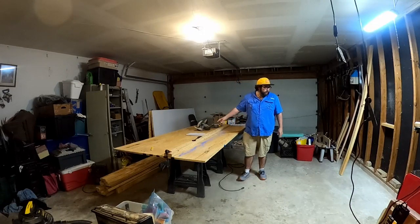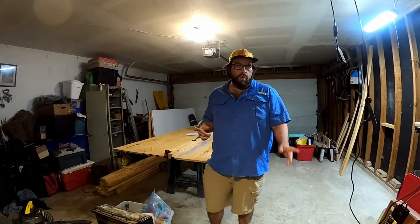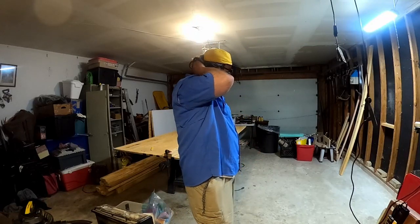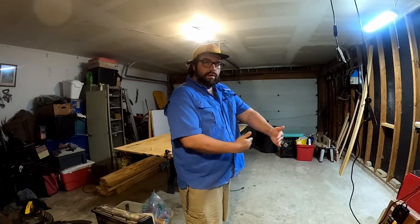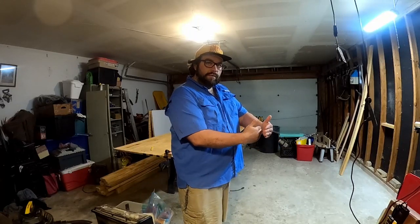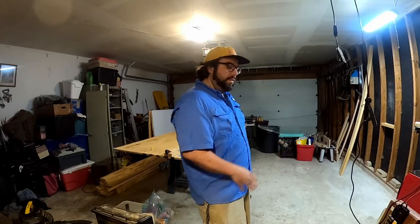We'll have the top layer for the top shelf, and then we will move over to working on the workbench itself. Like I said, it's gonna be 8 foot wide, and we're gonna come out 3 feet. So the top shelf is gonna be 3 feet. The bottom shelf is gonna be 1 foot. So that way when you're sitting at the workbench, the bottom shelf is farther back to give you leg room while you work under the workbench.